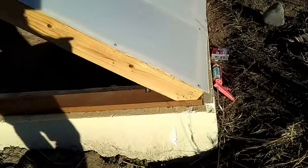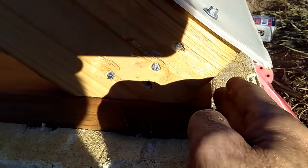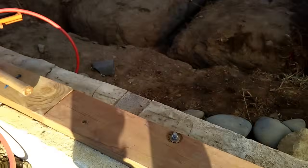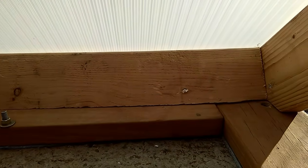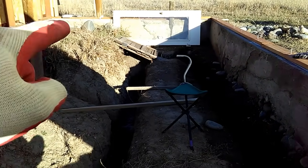You want to make sure there's a drip edge so your glazing extends past the edge here to trap all the heat — you don't want any leakage. All the heat will be trapped and go up into the greenhouse, and this will also shed everything past the entire structure. There's going to be a fascia board that I'll put on, coming just short of the edge. Coming inside, it's key to make this entire thing super airtight because it's a geothermal greenhouse. You can see these nice tight alternating cutoffs, and halfway up through the 12-foot run I have little support crosses so I can attach and maybe hang some shelving for raised sprouting beds.